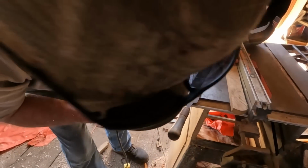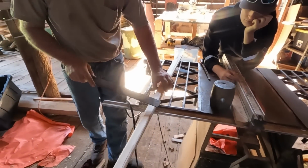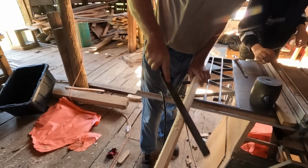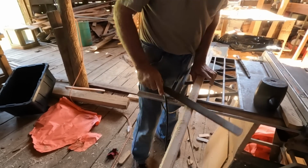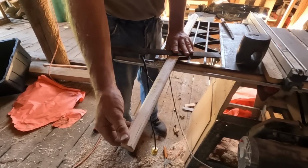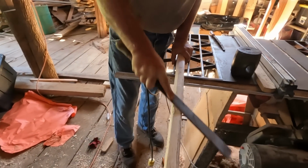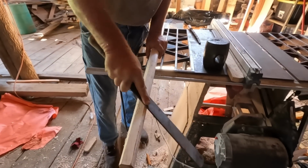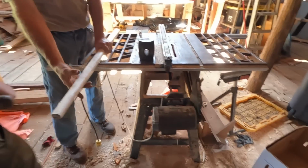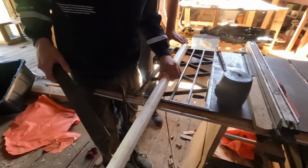All right, don't go no smaller down there. The handle won't be no bigger than this. That's one thing I don't like about the hammer handle, because it's little till it gets up into the bale. All right, bud. Run the corners off, make it kind of oval. You've got to match that shape right there. Just don't get any smaller than that.